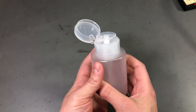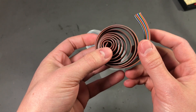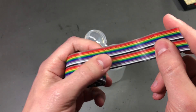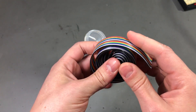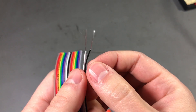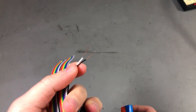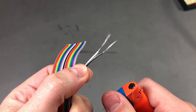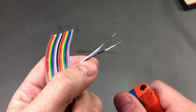Next is this rainbow ribbon cable, AWG 28 size. Interestingly, it has a bunch of markings and looks to be copper inside judging by the color of the wires, but to be sure this is not aluminum coated with copper, let's do the flame test. Remember: if they are pure copper, the wires should hold their form and just glow red, but if they are aluminum then the wire will become soft and then brittle.